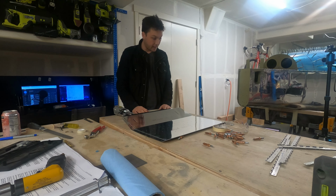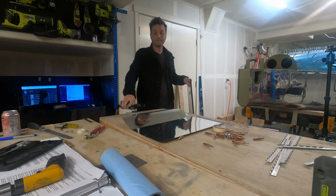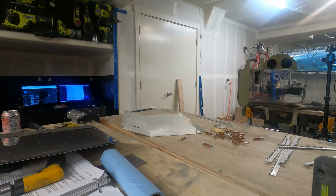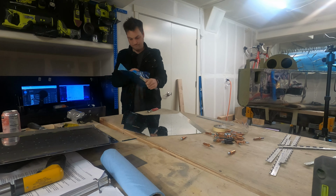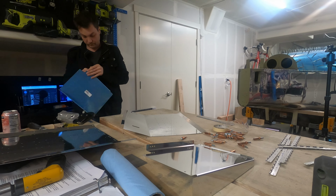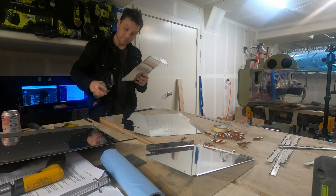The thing about time lapse is that inevitably you'll forget to turn it off at some point. Here you're going to see me dimpling the seat pans. This will allow for the installation of nut plates, which will later attach tunnel covers. I'm doing a similar thing to the flap covers, again dimpling those skins, prepping them for prime, and we will later be installing nut plates for those that will actually attach those pieces to both the side ribs of the baggage compartment and the baggage floor.